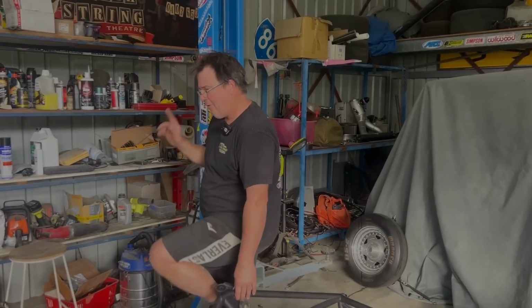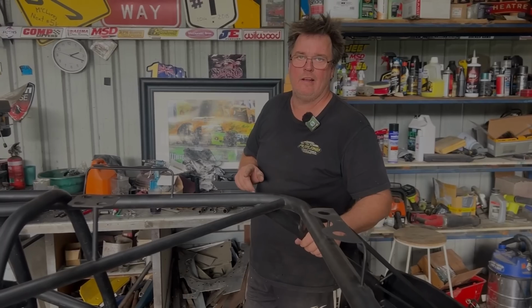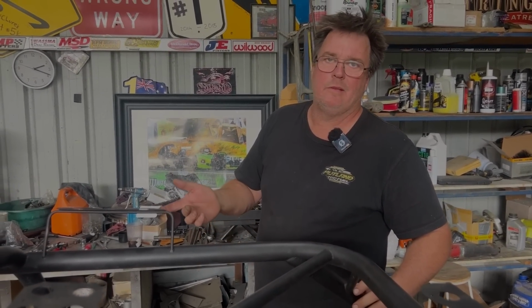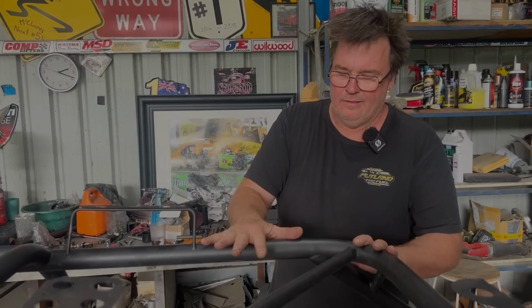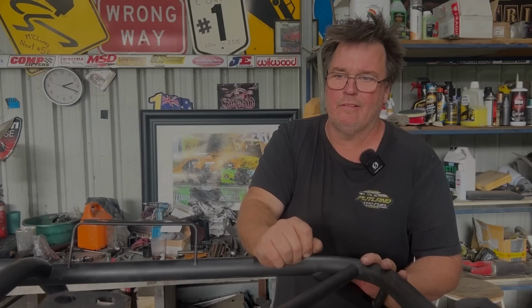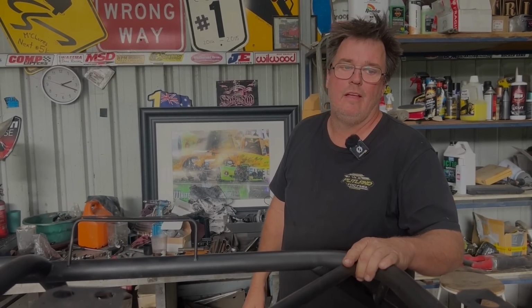does all its work. But on the way back to the ARB, one of the biggest questions we always got asked with the Torana was, why do you have it left-hand drive? When they're like, these are American cars. People don't ask the question because they think it's because it's an American car, but it's all related to this lift on this side and to have even weight in the rear of the car. So a drag car will almost always be left-hand drive to assist with this weight distribution in the rear of the car. You can make it work with right-hand drive because John Zappia's car is right-hand drive, and that works just dandy.